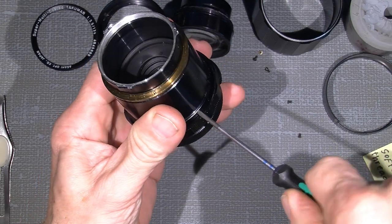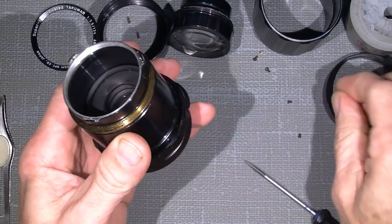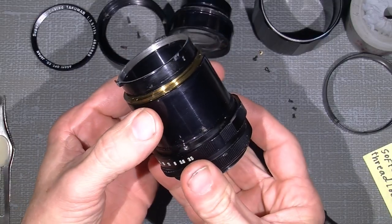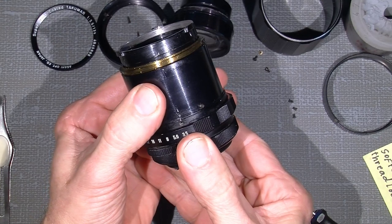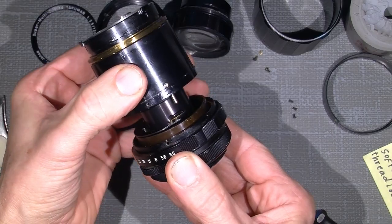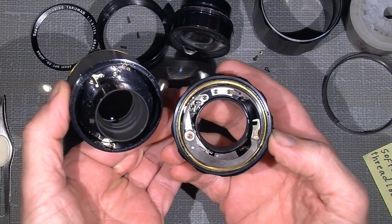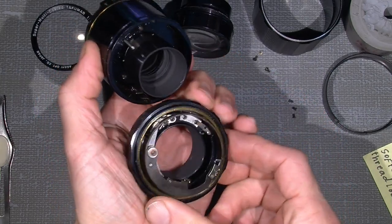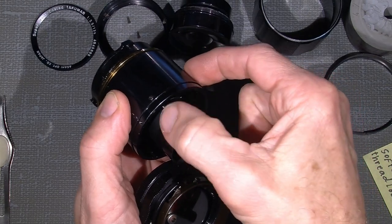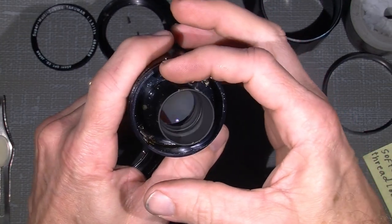And then the last screw is here. So it's countersunk screws. Now lift off this part here by simply opening it, and you will see what's actually happened here. So this is how it looks inside. See, the fork here is connected to the pin here. You can see the aperture blades, there is not a problem there.